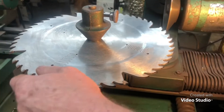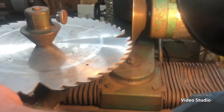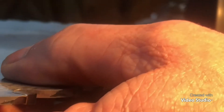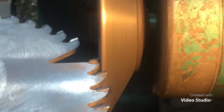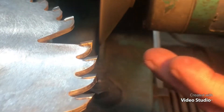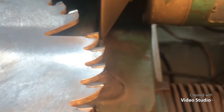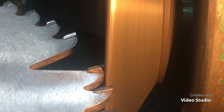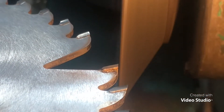We ground that. We found the flat. Let's see what we'll do. Touch off. Let's bring her back. Grind her up. I need to go — it's short. I need to go ten thousandths. There's five. There's five. Let's go five more.